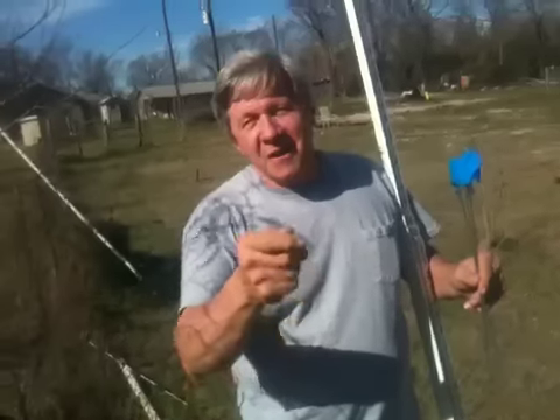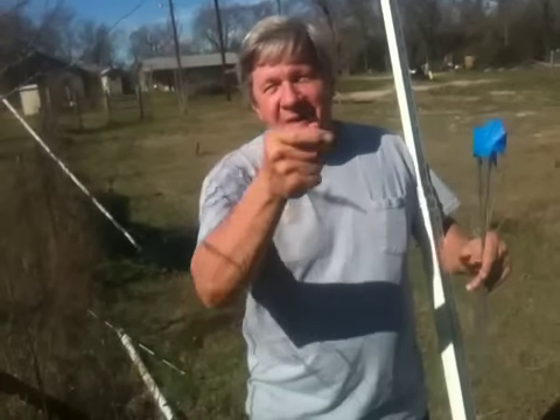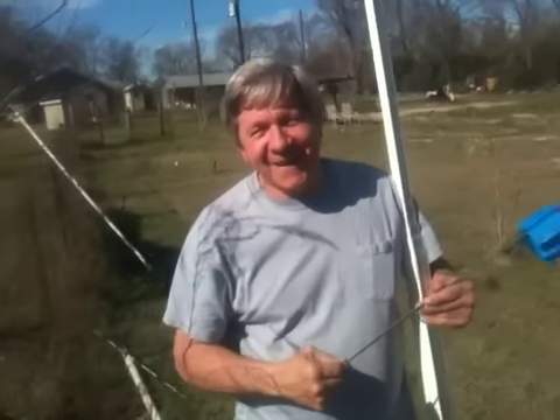I've got 2 foot of drop between my contours. You know that I'm going to go 100 foot between contours. And then my road is going to zigzag, and you can see all the corners — they follow the rules, except for down there, and then I have erosion down there. So as soon as it jumped to 3%, I start paying for it. But that's simply how it's done. How did I know where to put the road? That's what we're going to talk about.